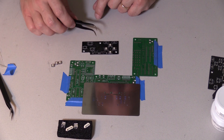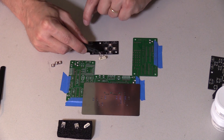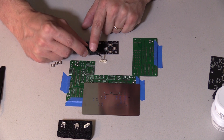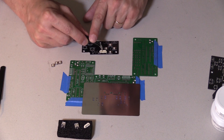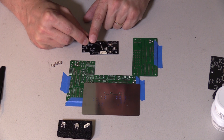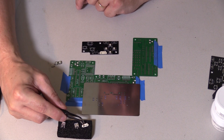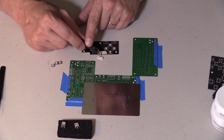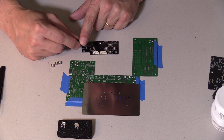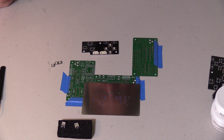These connectors are kind of in front of these buttons, so let's do the connectors. Same process — grab your connector. It's a little bit different; I can't really grab it on both sides, so it's kind of an awkward thing to grab onto. Just kind of get used to holding it and putting it down. This one I will drop a little bit because I couldn't bottom it out, but the solder pads are big enough where I can eyeball it. By dropping on it, it's like we're just barely hitting the solder paste and letting go, but I do have to nudge it if that's the case.